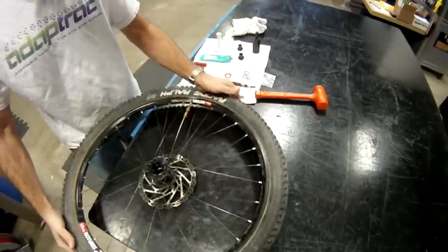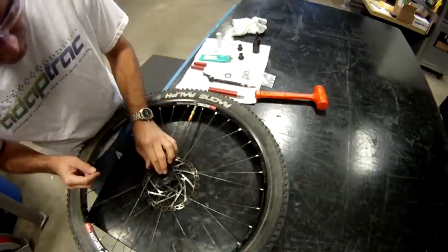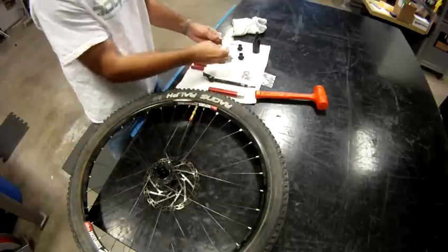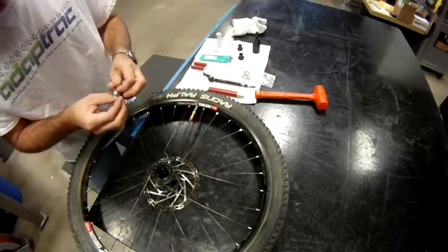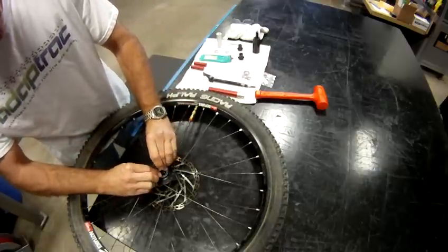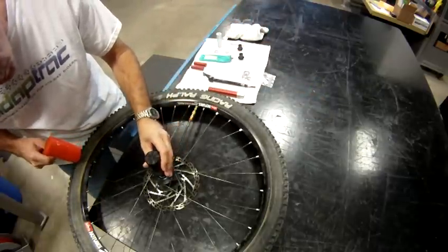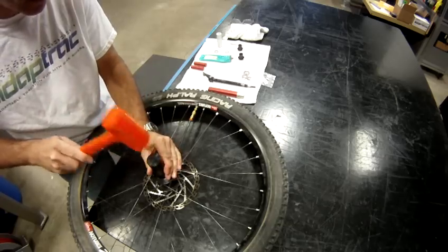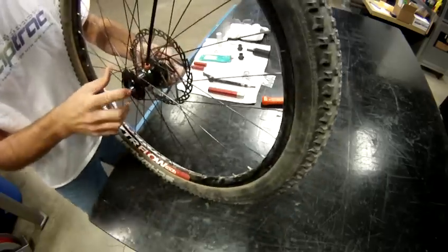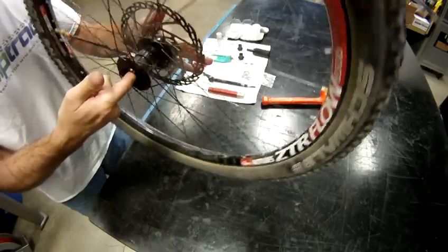On the other side now, put the bearing spacer cap in there, and it'll just ride up on that. Again, a thin layer of grease on the outside of your bearing just to make sure it doesn't gall. Put that in the lead, and again, using your bearing driver, put that in and drive that all the way home. Now you should be able to put your fingers in there and feel that there's no play, that the wheel spins nicely. It's spinning on that seal.